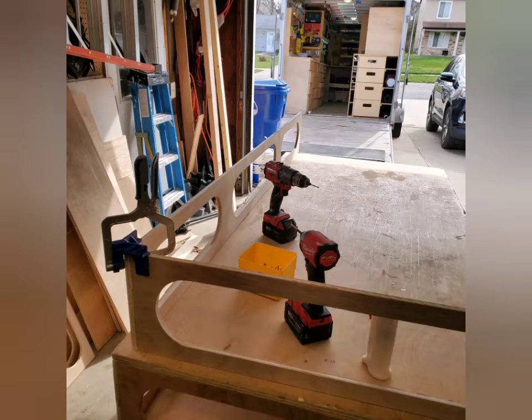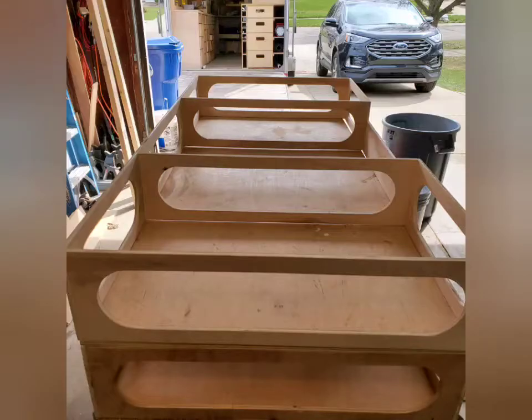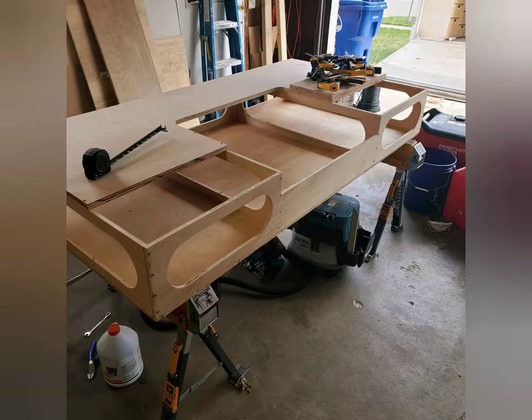Those corner clamps really make a difference. I glued and screwed the sides, and I left the top and bottom just screwed because those are going to be wear parts. Here's all of them together — screwed and glued on the sides and just screwed for the bottom. I took my time with this one as opposed to the one below, which is kind of not-quite-square. Here's the top part — screwing the top, making sure everything's fitting correctly, using clamps to keep everything square. I'll be making the clamp holes on a later date, but it's coming together pretty good.